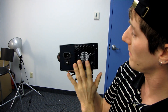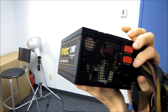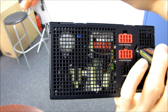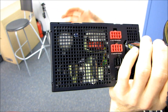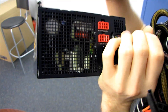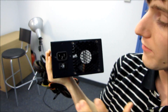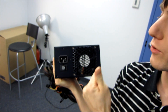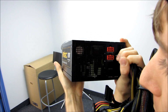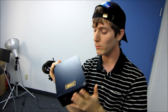We've got a power switch as well as our power cable input, and around the other side there's a grill at the front. This power supply uses a dual PCB design — there's a PCB on the top of the unit as well as on the bottom. That gives a lot more room for soldering and allows them to effectively lay out components internally so there's very little air resistance for the 80mm fan. You can actually see clear through to the other side — that's why, even spinning at low RPM, it can effectively move air through the unit.